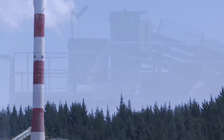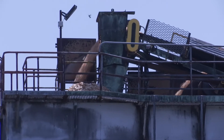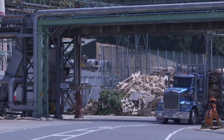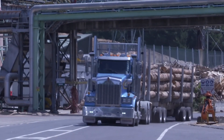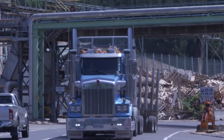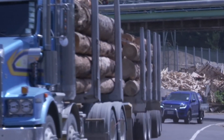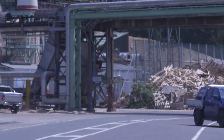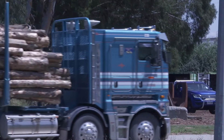The truck's fitted with our system because the operator wants to have grease while the thing's moving. Rather than do a manual grease once every few thousand k's and stop while it's static, this system can deliver grease while the truck's actually moving down the road and doing its work. The grease is delivered around the points and into the wearable parts everywhere it's needed as the truck goes about its day.